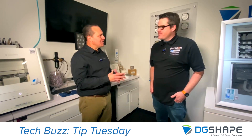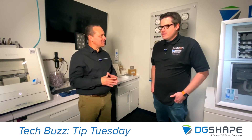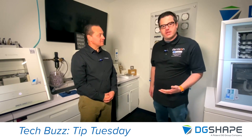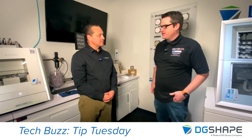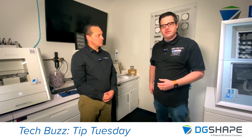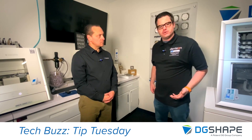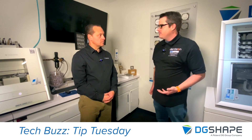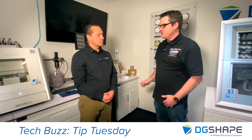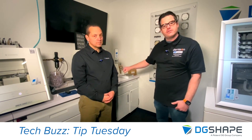Have you heard anything in the field about regulators, fun stuff that we can tell the customers out in the field? At Dentian we touch a lot of machines that are older and actually don't see a lot of the maintenance on the day-to-day basis. One of the common things that comes in is: my zirconia is kind of cakey, it's getting everywhere on the machine, and my spindles are failing prematurely. A lot of times that comes back to having water in your compressed air. Aside from having your air compressor properly configured, the machines actually ship with a water separator, but a lot of times people fail to look at that water separator. You'll have water buildup in there, which will just propagate through the machine and get on your parts.